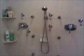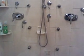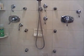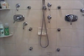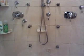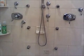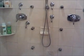So, now, what's key to installing body jets when they're piped is that the piping cannot be in series. Basically, a pressure manifold needs to be made to distribute the volume of water out of each sprayer equally. If that isn't done, what will happen is you'll get more volume out of one sprayer than the other. So if they're in series, the one in line closest to the supply water will get most, and the one farthest away will get the least amount of volume of water.